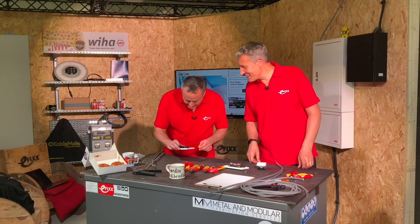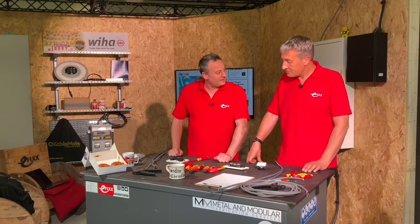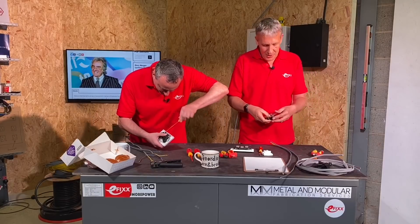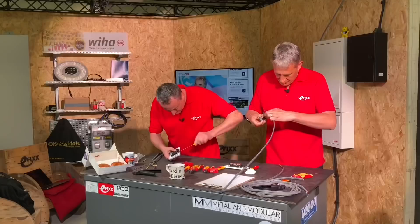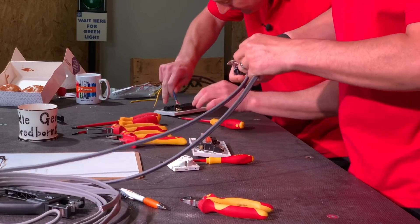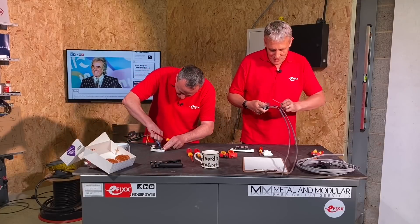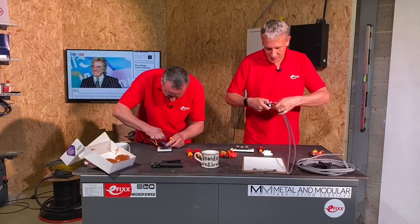Right, okay — they're not backed out of course. So ready, steady, go! Neutral first — undo the screw — while Gary's backing out his screws, you'll notice in here there are just these little push terminals, so I just push that down. Line conductor goes in there nicely. Let's put the CPC in, let's put the neutral connection in, and repeat for the second conductor. I'm nearly done. No sleeves slipped off there — they don't have that in Germany — and there we go, comfortably done.